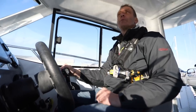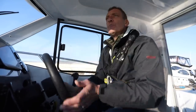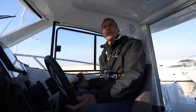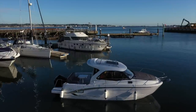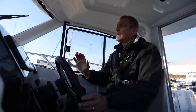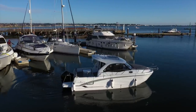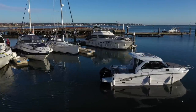Sometimes we need just a little puff. When I go in gear the boat doesn't dramatically move, and particularly when I reverse the helm — this one's got quite a lot of turns so we'll get that all the way around. Going astern it's not biting greatly, so sometimes I need just that little puff of revs — just to give me that little bit of extra bite. You need to practice because it's more to do with listening carefully than watching a rev counter. It's not about speed, it's just about a little bit of momentum and grip.